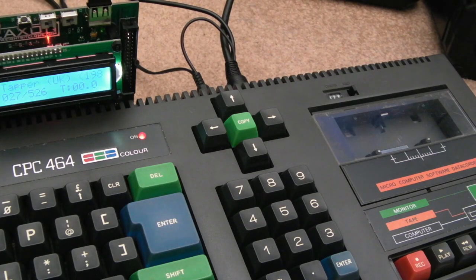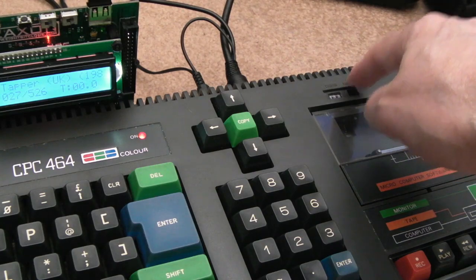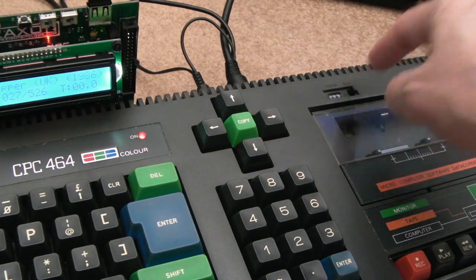So we're all done. It was the LS32. It was amazing that I landed on that chip. There was no planning or anything on my part, seriously. I went in with a logic probe, thought, let's have a look at that LS32. I know how LS32s work, it's a really easy one to test. And lo and behold, it was the LS32. It's just unbelievable. And obviously we replaced the little reset button here with a 3D printed part.